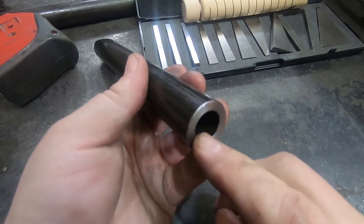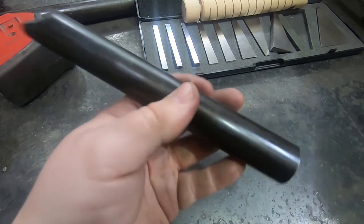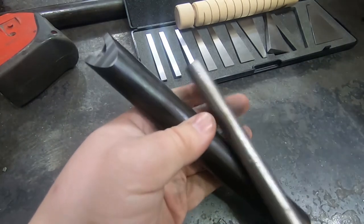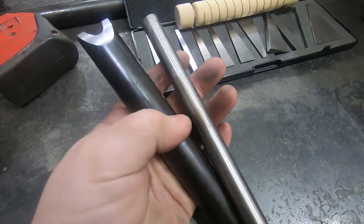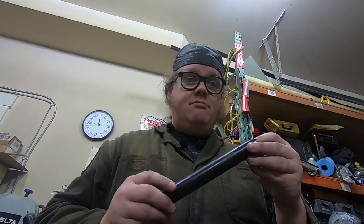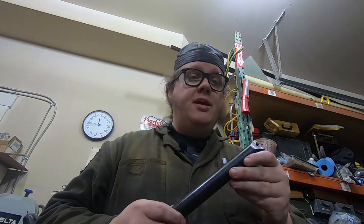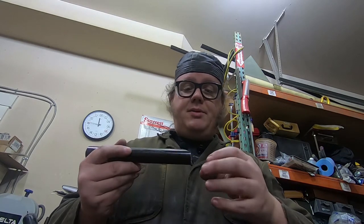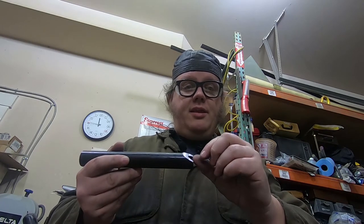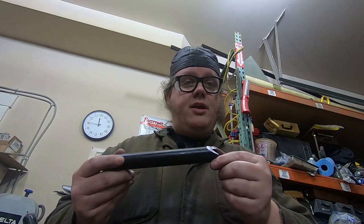The walls are 3/16ths, so together they are 6/16ths — aka 3/8ths — so the gap inside is 5/8ths. I don't have any 5/8ths rod on hand, but I do have a 9/16ths rod which is pretty close. So yeah, that's looking promising. I was having to adjust the exact angle of attack and the pressure quite a bit, so trying to do that with an air compressor might be a bit tricky — but looking promising. The next step is still to make a sleeve that can fit on here to get that little sliver cut out to help direct the air. So on to that.